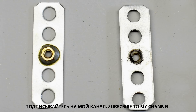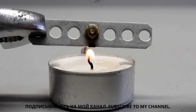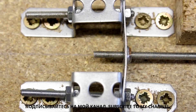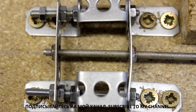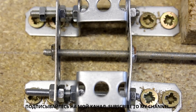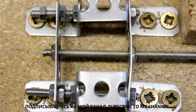On the other hand, the cheap press nuts might have to be replaced after several hours of operation. If your soldering iron hasn't enough power to heat up the metal stripe, you can use a candle. There is some clearance when using just one nut for the drive. The second metal stripe is mounted in such a way that the clearance is as low as possible. The lower the clearance, the higher the friction. The right adjustment is a compromise between friction and clearance.